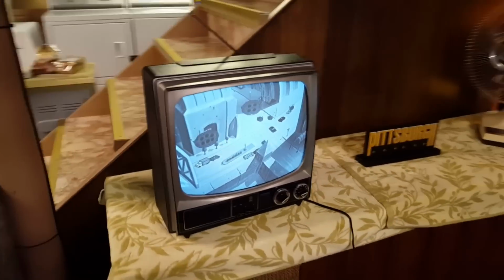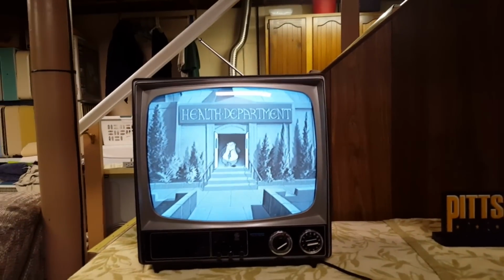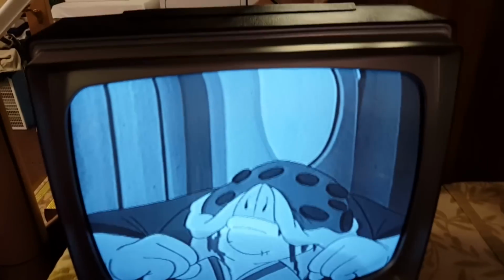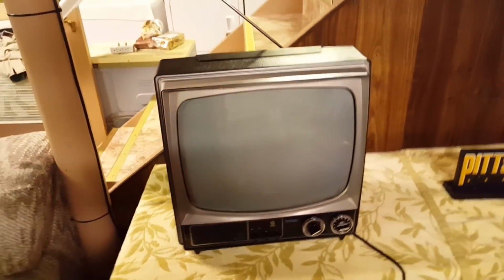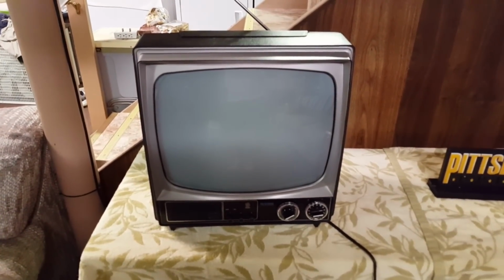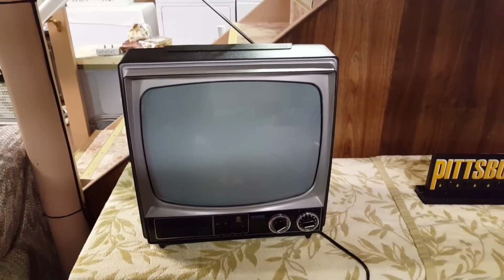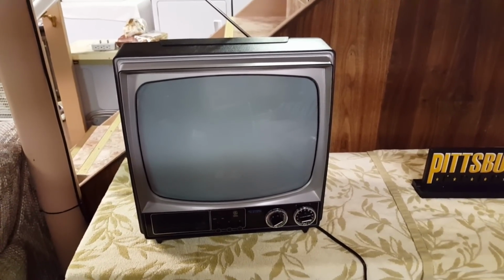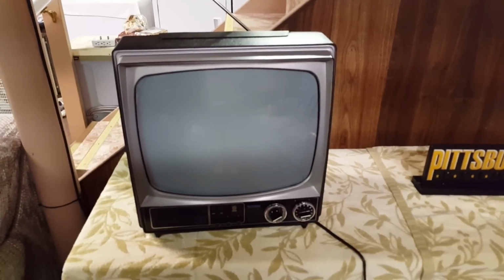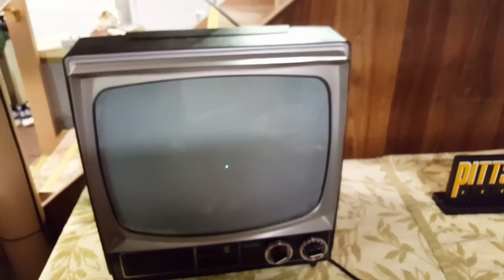So, that's it. Very nice TV. It has a very solid power switch. And I'm going to keep recording because this is one of those TVs that after being off for about 15 seconds or so, the cathode still discharges and lights up with a little dot in the middle. Here it comes. It's not very bright, so it won't hurt the phosphors, and it remains that way for about a couple minutes,